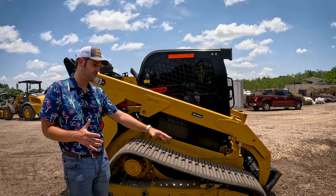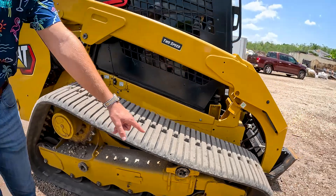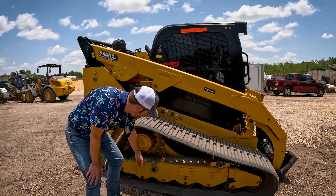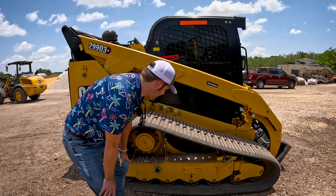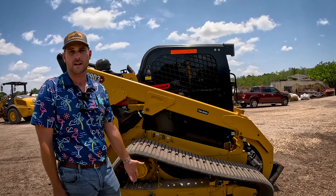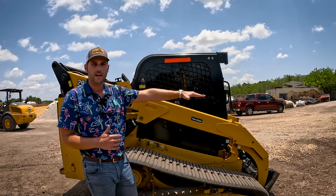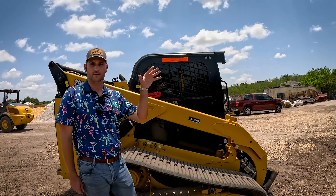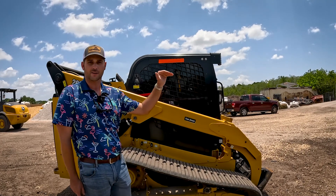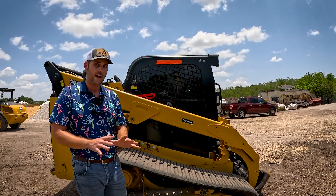This Cat is equipped with torsion suspension. If you look right here, that's where you grease the torsion suspension. If you look where they actually put the grease zerks, you're almost always going to have mud, dirt, and debris built up around them — it's almost one of the worst places you could put something you have to introduce grease into. Another thing: if you're loading trucks, the torsion suspension gives you kind of a porpoising effect — it will rock just a little bit whenever you've got your loader boom up in the air. If you've ever loaded trucks with one of these, you know exactly what I'm talking about.